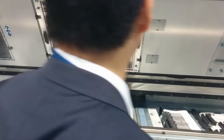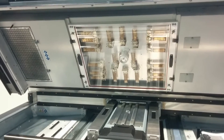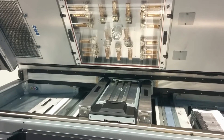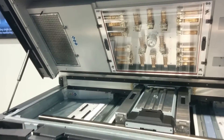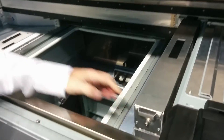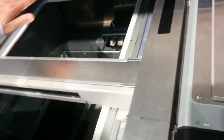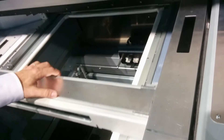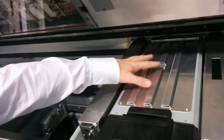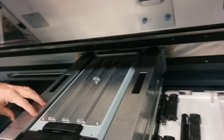What you see on the top are the heating lamps, heating up the print bed to a certain temperature which is just below melting point. In the first step, a roller spreads powder on the bed. It will move to the back and then we have the carriage with print heads inside and two fusing lamps on the left and on the right.